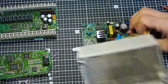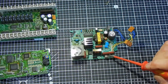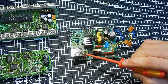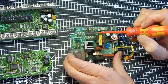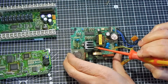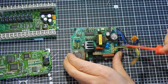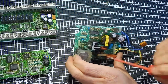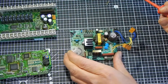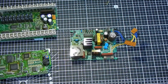And in the bottom of the unit, we have a 24-volt switch mode power supply, which again just prizes out. Very, very basic standard unit: the mains comes in, then there's a fuse, a filter, a reservoir capacitor, a controller IC, a MOSFET, a transformer, a rectifier, and the output capacitor — all the basic stuff you find in a switch mode power supply.